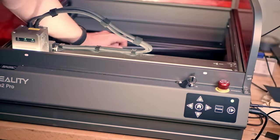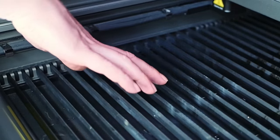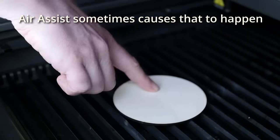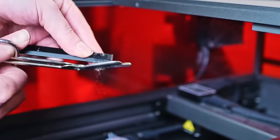Though nothing good without something to complain about — the bars have some play in the gaps. Normally that's not a problem, but it could ruin a multi-pass job when they move slightly between passes. To get rid of the sloppiness of the bars, wind some tape around their ends. Two to three turns should do the trick.